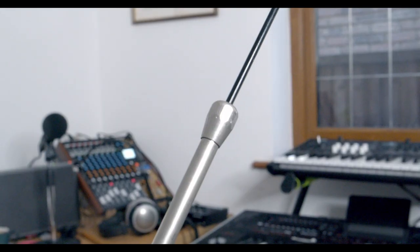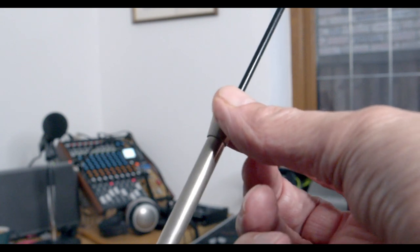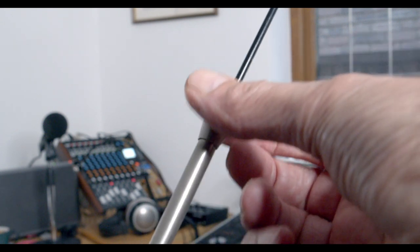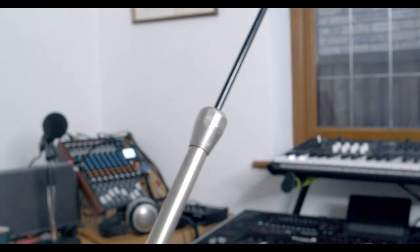I've always found that Diamond antennas work extremely well. They're very nicely made mechanically, and although I've tried various ones for HF mobile, I tend to migrate back to the base-loaded quarter wave. A base-loaded quarter wave is a very popular antenna because it's quite compact and simple to adjust. Diamond quarter wave antennas have a nice little clutch arrangement — you just turn this clutch and it immediately lets you adjust the length of the resonator at the top section of the antenna, then lock it in place. It's a fiberglass top section with a copper conductor inside. It's a nice compact antenna.